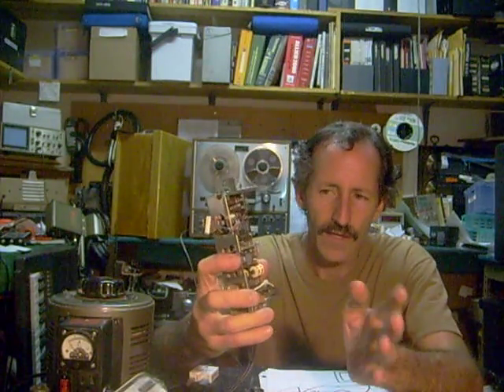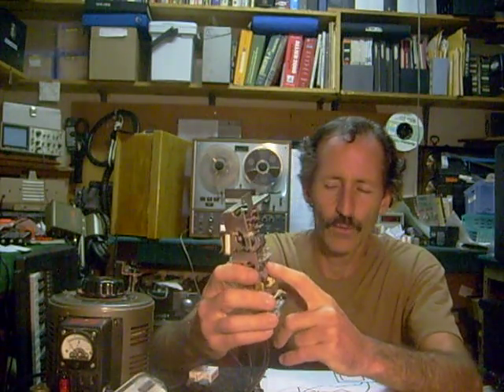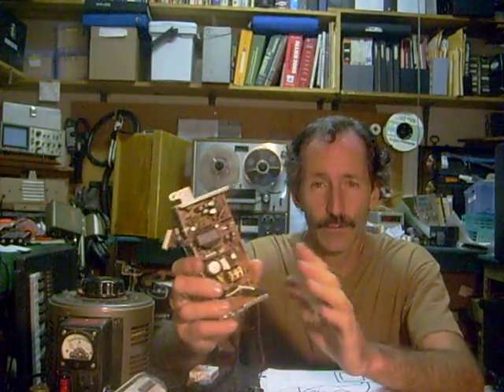What I'll do in an instance like this — the first thing I'll do is check a transistor that I suspect is shorted. It'll check just like a straight-across piece of wire. It no longer is a semiconductor; it's a full conductor. And I'll just go on the backside of it and check it with my diode checker.